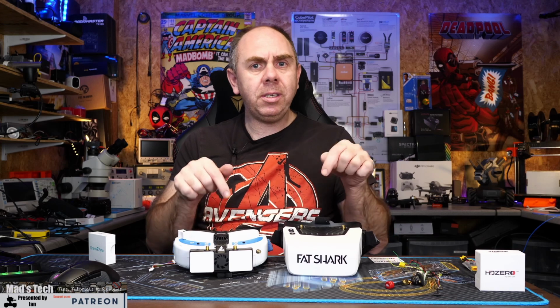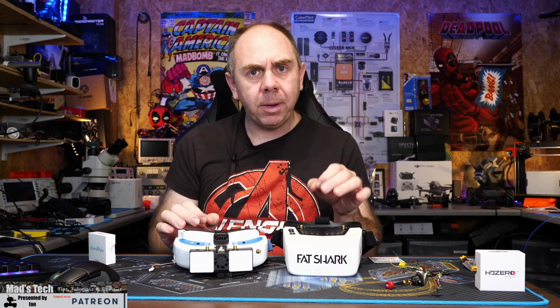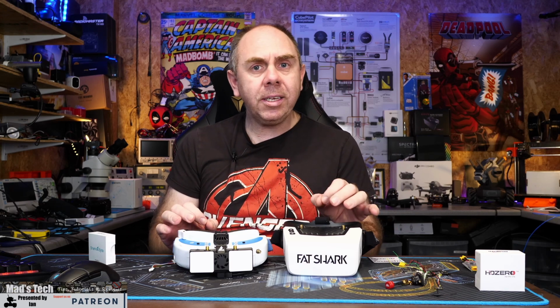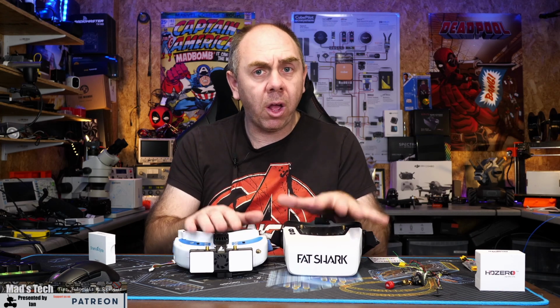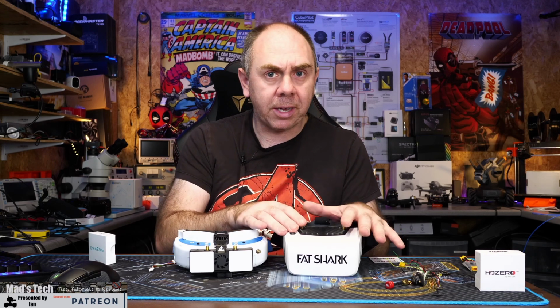At this point in time, there is no check in place in the HDZero system to make sure that you are installing the correct firmware on your module. It is extremely important that you do not put the wrong firmware on, otherwise you could end up causing a failure or a bricked device.